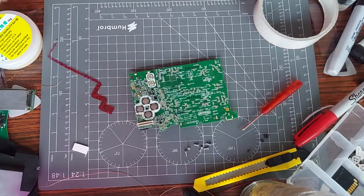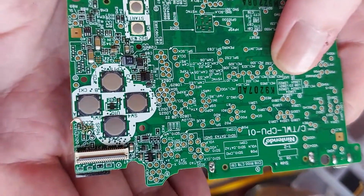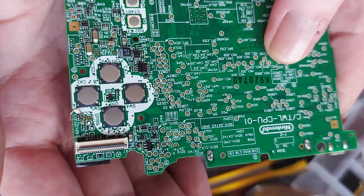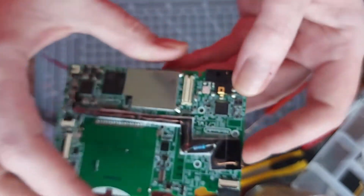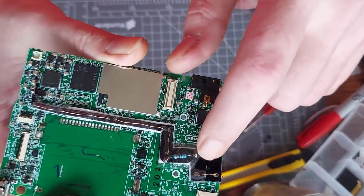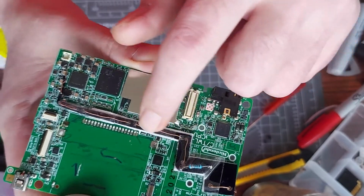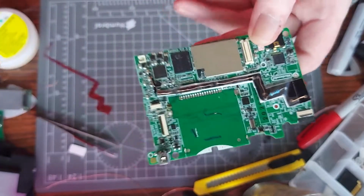And that's stuck down. That seems lovely. I'm liking that. Focus. Can you see directly above where the 8 is? That's where the other side's going to. So we've got my enamel wire running to that, which goes to one side of the 330 ohm resistor, which then connects the circuit to the other side of the leg down there. And that's it, that's the macro mod.